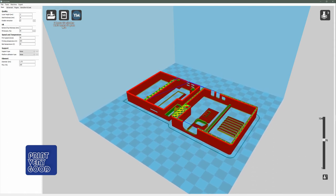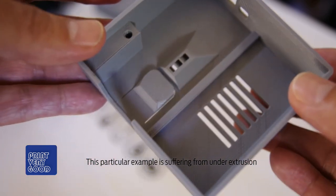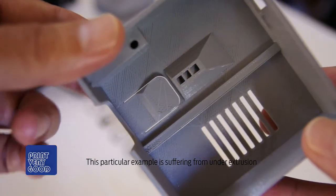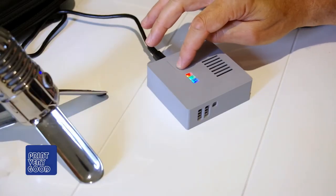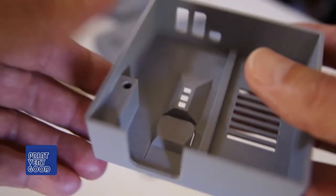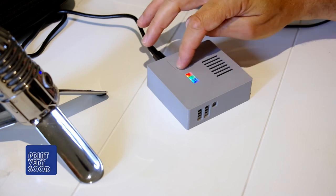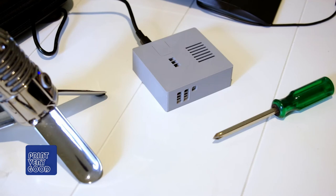For the button, I ended up settling on a design where the button is part of the lid and flexes to press the circuit board button below. This works quite nicely, as there is minimal flex needed to press the button and it also provides good tactile feedback. For the LEDs, I came up with a tapering hole design where each hole leads directly down to each color LED and the light bounces up the shaft. This works surprisingly well — the light is easily visible, each color is nicely separated, and this design has the benefit of being one piece with the lid.